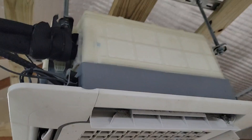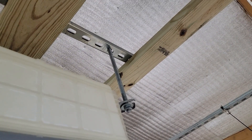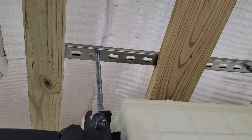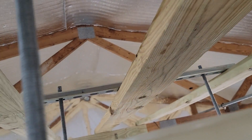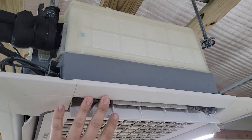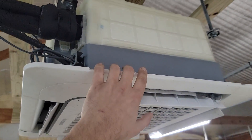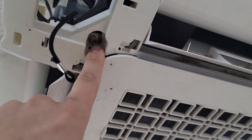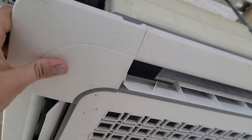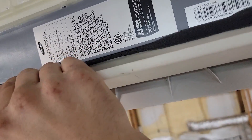The first thing I want to talk about is the installation characteristics. The difference with the four-way is you have four corners, and you can see there's a bolt, a washer connected to all-thread, and they go through the four brackets on each side. Then you have unistrut up there with another washer and another bolt. You have to frame it out — doesn't matter if it's wood, sheetrock, or drop ceiling, this type of equipment will work for either one. You've got a fascia panel with four corners and four screws to attach it to the cassette's chassis.